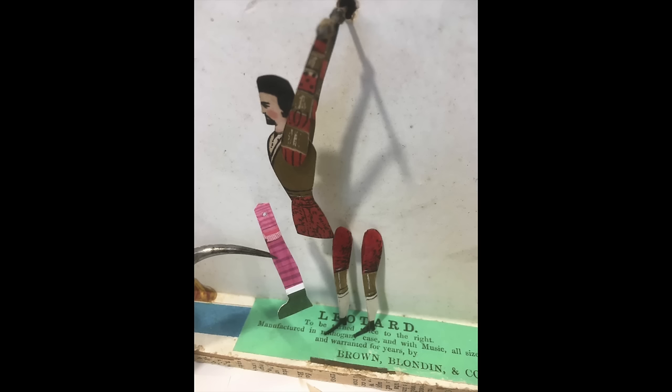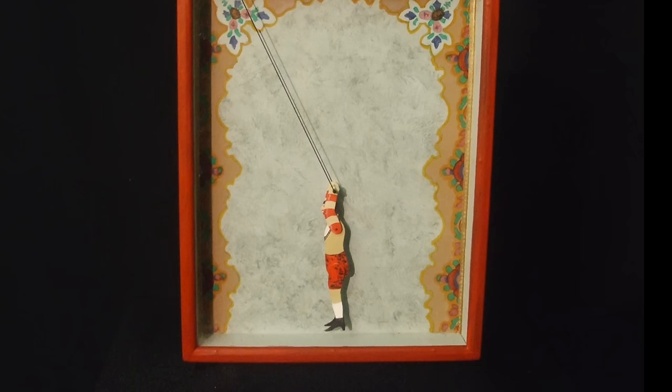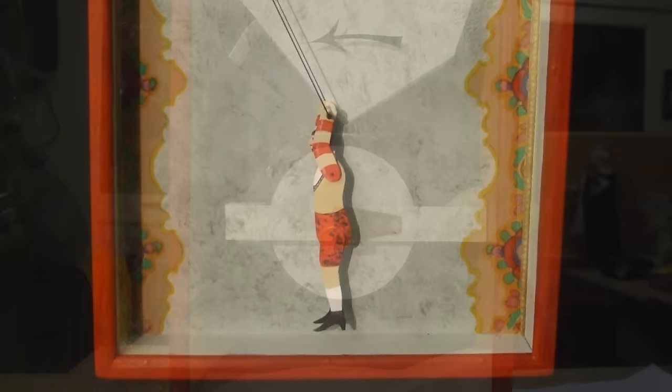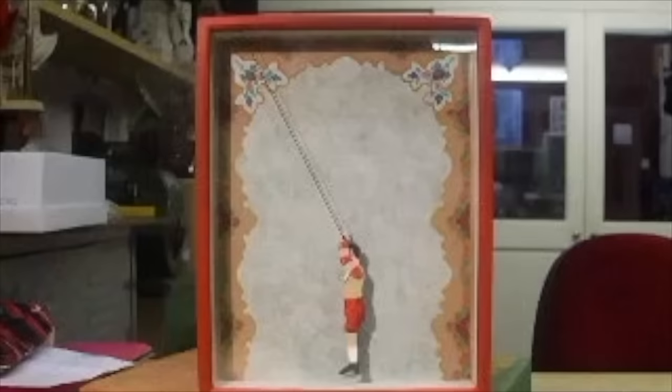We've repaired many of these sand automata. This one came with a single badly drawn and painted leg — obviously he needed a pair of replacements, and there you can see the replacements in the background just prior to fitting. We were also commissioned by a museum to make a demonstration model robust enough for the public to handle. Here you can see we fitted a Perspex back so whoever was operating it could turn it round and see exactly how it worked. You can just see the glass bearing held by a little bracket at one end of the wheel. To wind him up, you turn him over until all the sand has fallen into the hopper — placing it upright, off he goes.